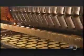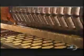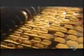As they travel through the fryer, rolling molds give the chips their uniformly concave shape, making them more easily stackable. The chips spend 11 seconds in hot oil crisping. Then they travel under blowers to get rid of excess oil.